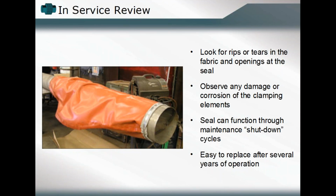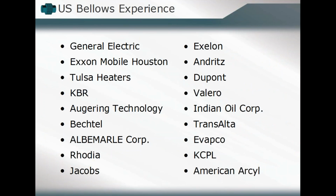And then you want to ensure that if some of the components can be maintained, maybe the flange is still in good condition, maybe all those metallic components are still relatively serviceable, and only that fabric belting material has to be replaced. You may have the necessity just to replace the fabric belt component itself, and that's all, and keep the original flanges if they've not exceeded their life cycle. Maybe we just have caused some damage to that belting material. Have the opportunity then, in that case, to replace only the belt. So that basically brings us to a close of our overview of fabric expansion joints.